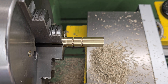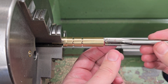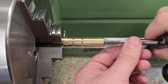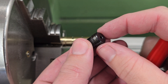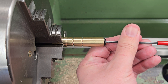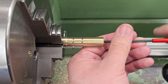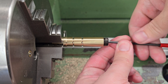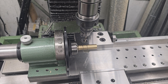I've found in brass that to get the best finish you do need a little bit of load on the tool — if you're taking very little material out the finish isn't the best. So we came through with a 6mm drill bit then finished off the valve seat using an 11mm drill bit. With that done, the next thing is to put an M12x1 thread in the very end of the piece which will accept the adjuster for the valve, cut using a starter tap then finished with a bottoming tap to around 10mm deep. The final thing in this setup is to test fit the valve adjuster, which allows us to adjust both valve return spring pressure as well as valve travel. This little piece acts as a blocker so when the valve opens, the travel is limited by this piece and a buffer O-ring.